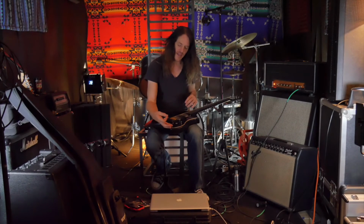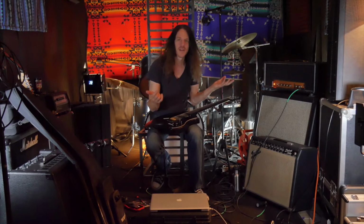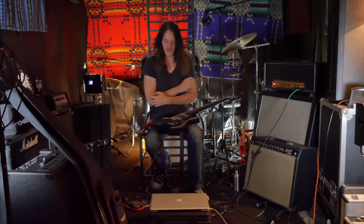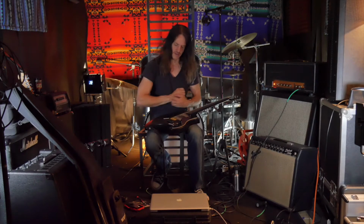Well, once I got that DeoxIT in there, this thing really stopped making noise. It's amazing. So now I'm probably going to make some noise now that I've said that. But compared to where it was, almost unusable. You had to leave it set, and it was wonky in that as soon as you started turning it, you could tell it was killing the circuit. There was a dead spot somewhere. And so the DeoxIT got rid of that. Amazing product.